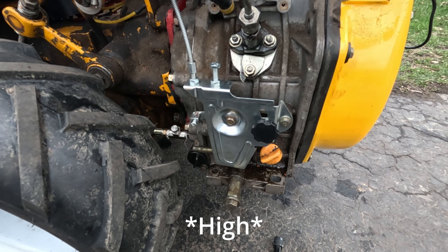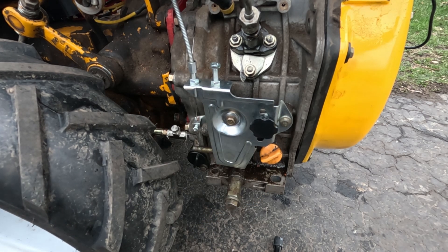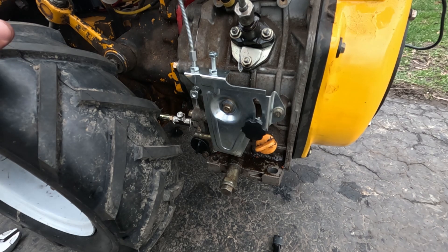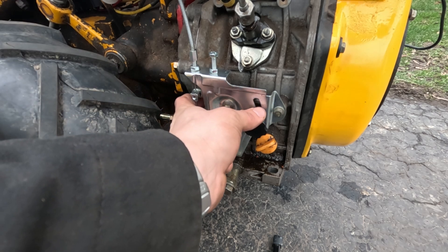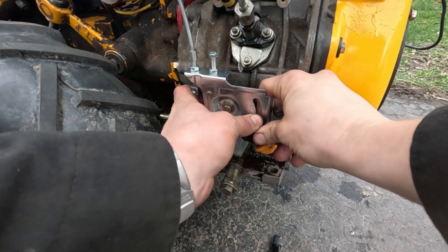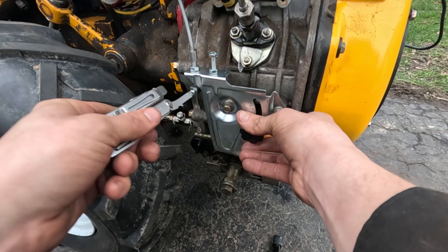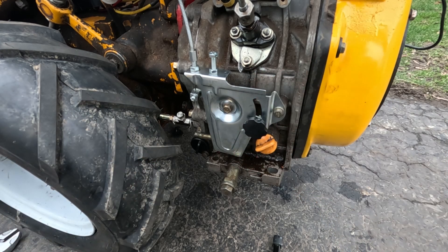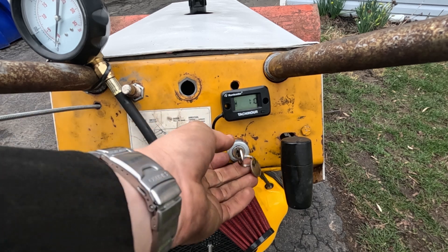Right here it doesn't have enough fuel to run at very low throttle, so we only really have maybe half of our range. We're going to put our throttle lever to not quite wide open throttle, and adjust our throttle cable. Let's stick that all the way down there and see what that does. Having adjusted our throttle cable, let's see what we can get out of it now.